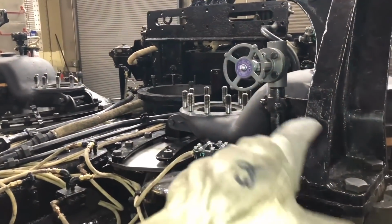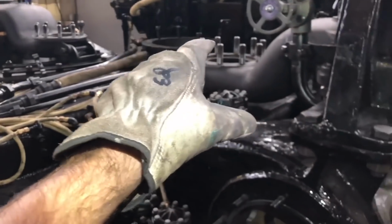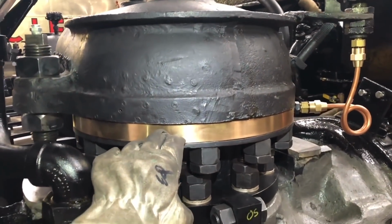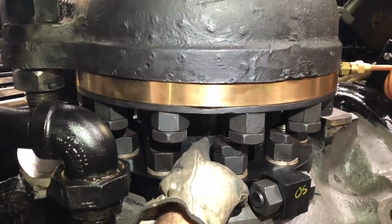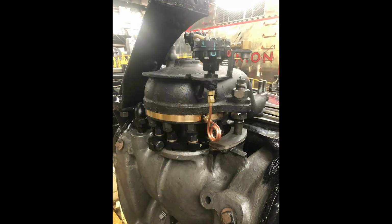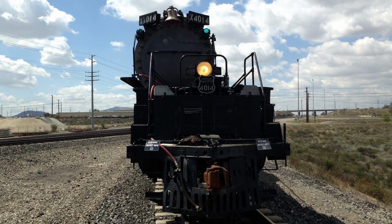All new steam lines, steam joints, wear liners, elbow support shoes, all new studs. Rebuilt steam line with a special cast alloy steam ball joint, spherically ground steam joint down right here, all new studs, all new machined clamps, all new piping, lubricator piping, terminal checks, air pumps. This has just been a massive project. And understand that this is only the front engine.